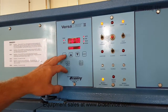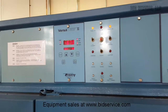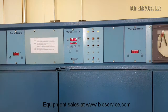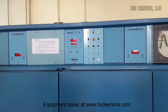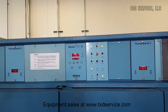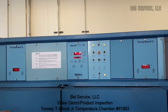I'll just show you a manual transfer. It shuts down the fans inside, it will transfer the basket and then turn everything back on. So as you see the temperature will drop and then over time it will recover. If LN2 was being used it would meet the MIL spec standard of 5 minutes air recovery time and 15 minute product recovery time.